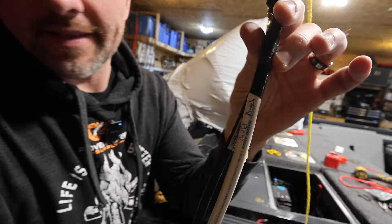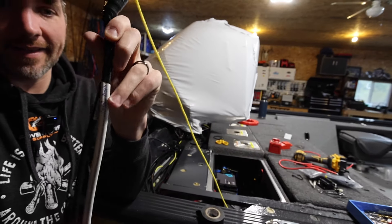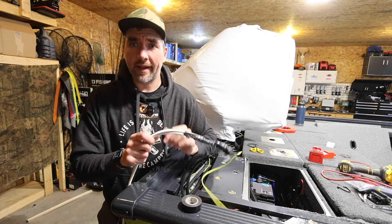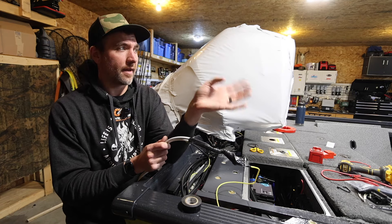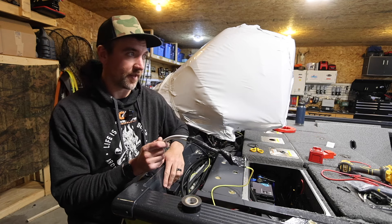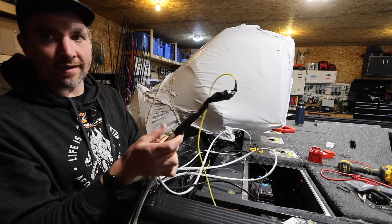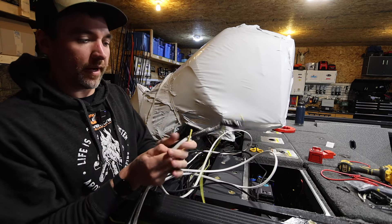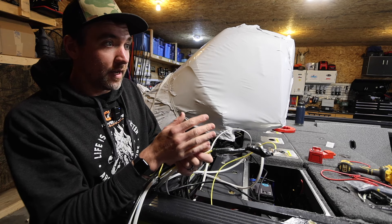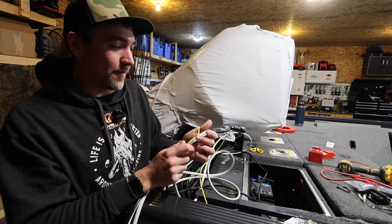This isn't anything fancy, but it's something that's easy to forget about: label your wires. You don't have to use a label maker — that's probably going to get cut off anyway. I know this one's going to the bow; the shorter run's going to the console. One of these runs is going to jump off at the console where I'll hook a bus bar, and the other goes all the way up to the bow. I almost forgot — and this would have sucked — because I'm pulling this rope through and chasing it with wires, I always want to add another rope to follow it up so I can keep that channel accessible. I still have another side imaging transducer I have to rig up through here. You never know if you have to replace something or pull it out. Always want that rope in there. Leave it in for the season — don't do the one and done.